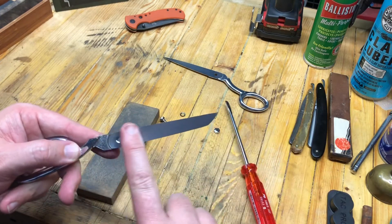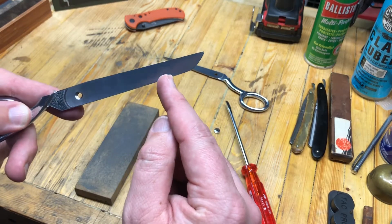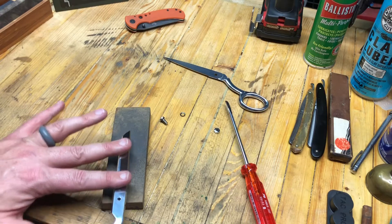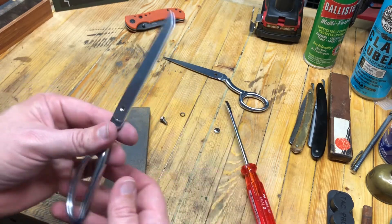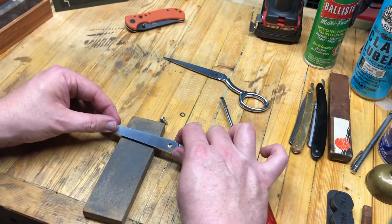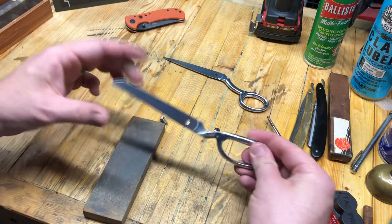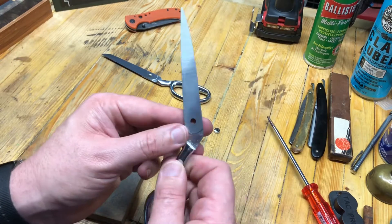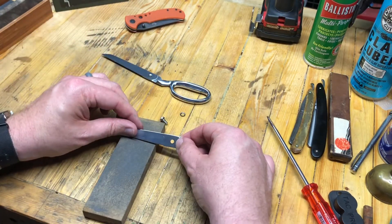This backside here needs to remain flat. You can see those little shiny spots — that is damage in the blade. So this needs to remain flat. You could place this on the stone and flatten the back, but we're going to see how far we can go with that damage. This is the side that has the bevel. It doesn't matter what the degree is because you're just going to follow that bevel. You'll set it on your stone and feel that flat angle — piece of cake. This side remains flat, and the bevel side sets on the stone and we will be able to sharpen.